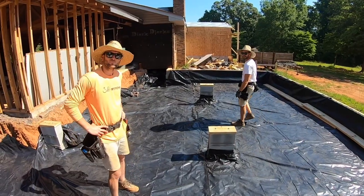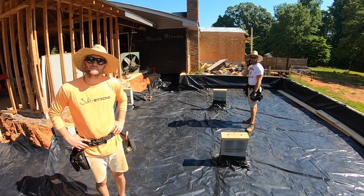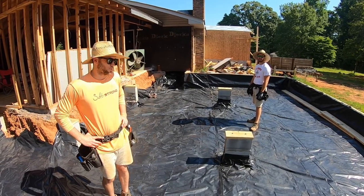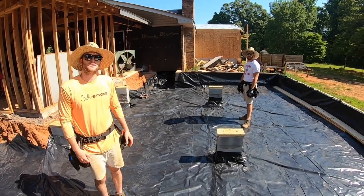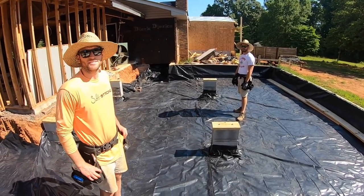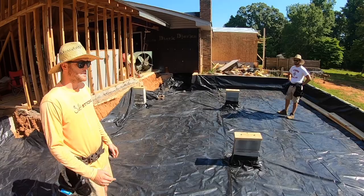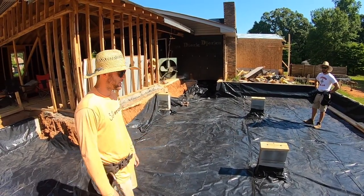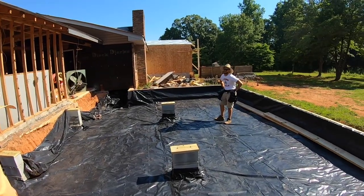So in layman's terms, this is longer than the other one and the wood doesn't reach as far. Correct. That's the reason we have the intermittent post support point. Got it. Yes, it's longer, but this might actually be easier than that side over there because the members aren't as long and as close together. And we're standing on the ground.